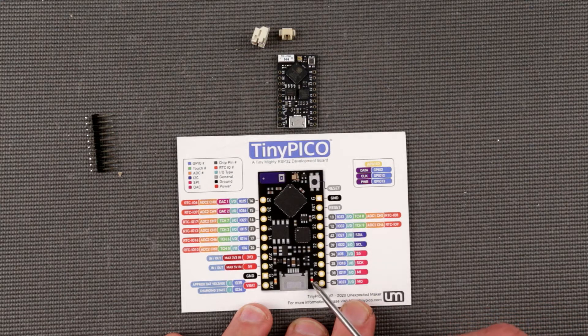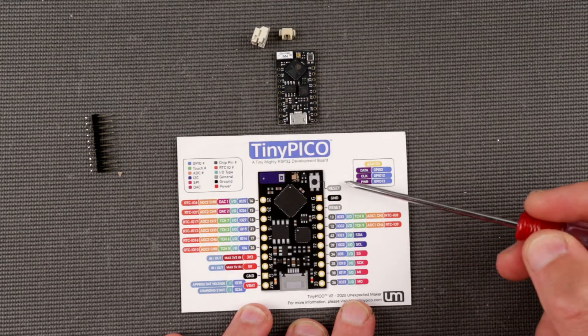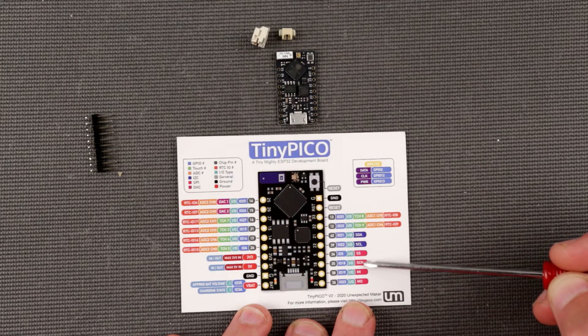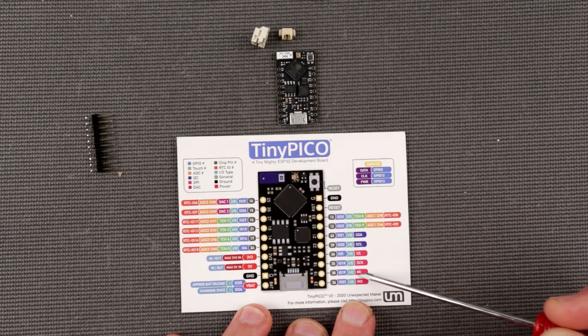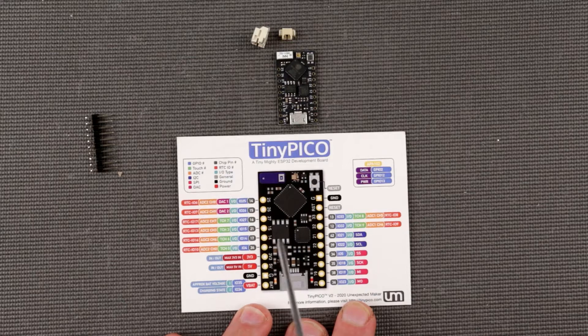There's a little LED over here that I think is for communication indication. I got confused for a second — I thought I was looking at SPI but this is actually I2S. I'm not entirely sure if this particular chip has pin-outs for I2S or if some pins may be taken up by the color sensor — but it potentially does support I2S.